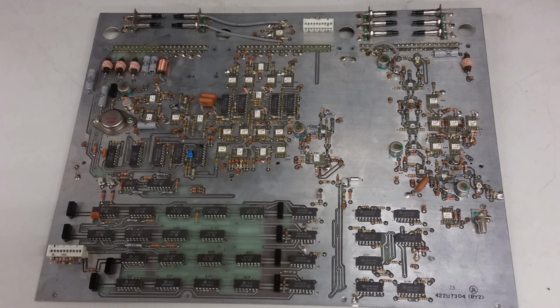What's he talking about, ECL? Well, ECL is emitter-coupled logic. It's one of those logic families in electronics that you really don't hear about anymore. But it was kind of the king back in the 70s and 80s. If you wanted speed, if you were designing a supercomputer, if you were designing some test equipment that just dealt with incredibly fast timings, you needed ECL.